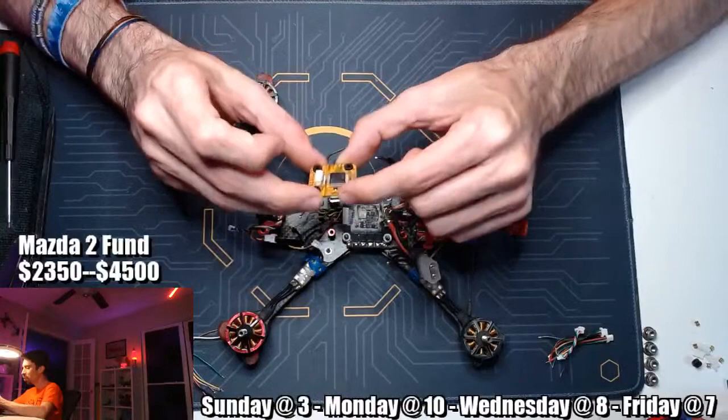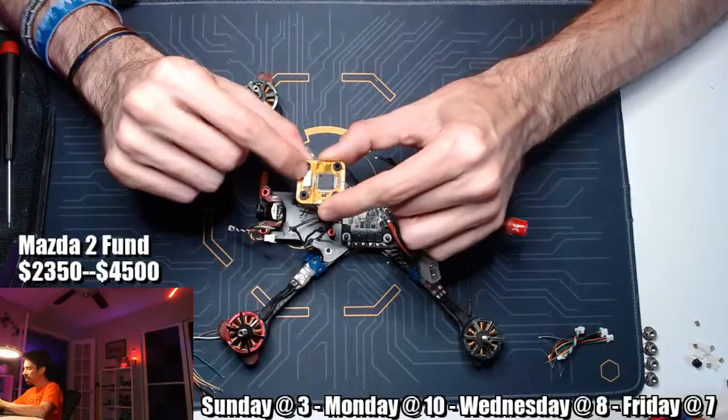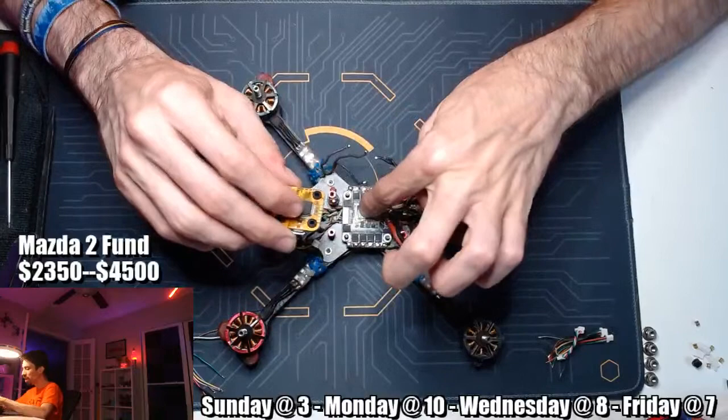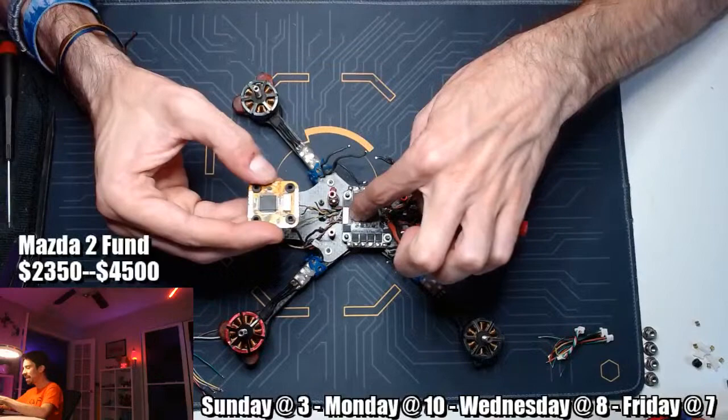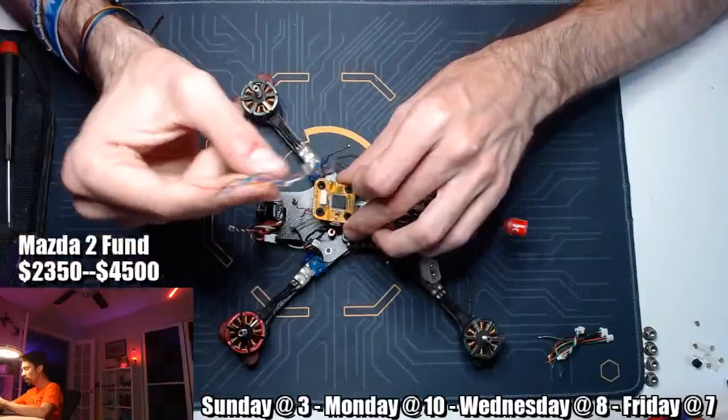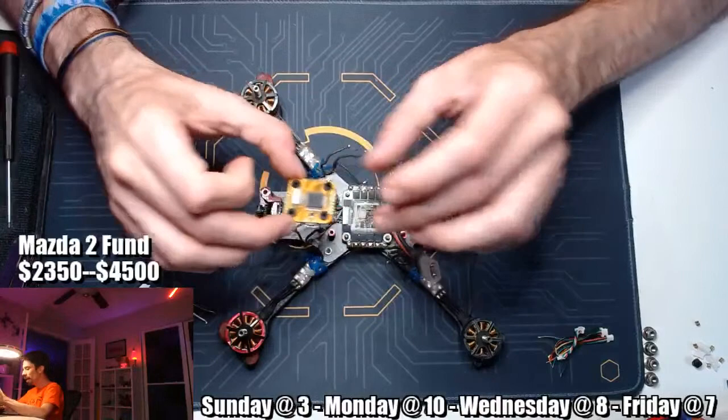That's kind of nice. The next thing that I usually think about is the big plug header that goes from the flight controller to the ESC. In some cases, these two things are going to be far enough away where you need to point that plug header directly at the ESC. In my case, that's not true, although it also depends on the cable that you're given. I have a million of these cables, so it doesn't really matter to me, but it's just something to think about.